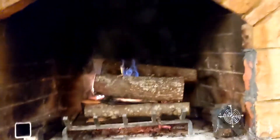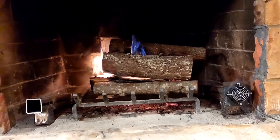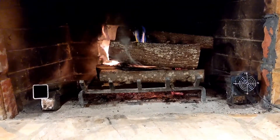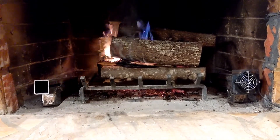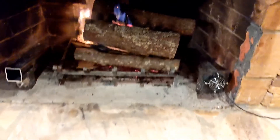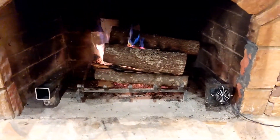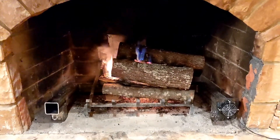So far it has not affected the way my fireplace is drafting — all the smoke is still going out the chimney like it's supposed to. The heat exchanger itself is not blowing any smoke into the room, so it's intact and working as it should. The air coming out of the outlet side is, at this point, hot air — not so hot that you'd hurt yourself, but definitely working as designed. The pipe on the inlet side is still surprisingly cool to the touch, so the fan is fine and not in danger of overheating. It is definitely contributing to the heat coming into the room. Overall, so far I'd have to say this experiment's been a success.